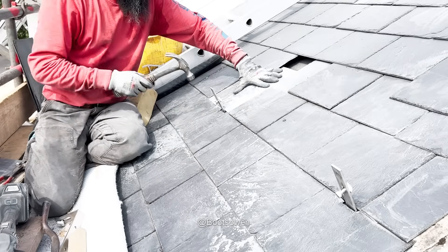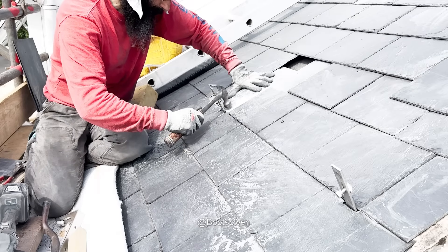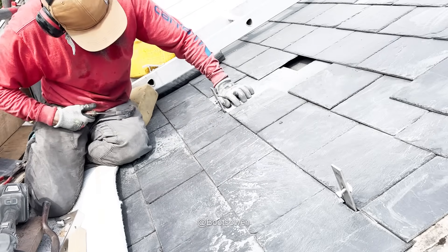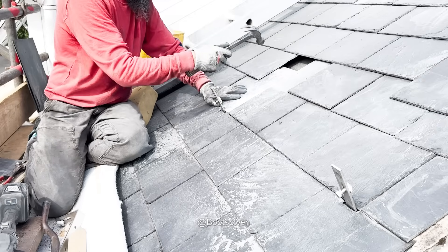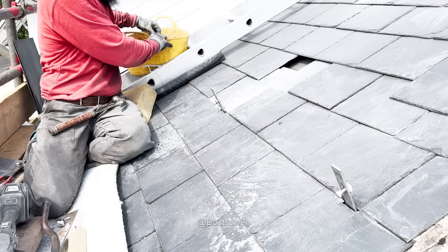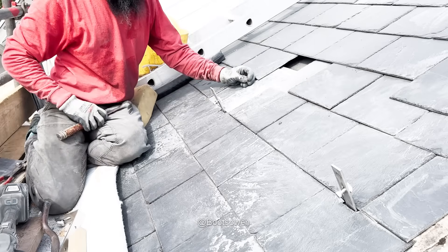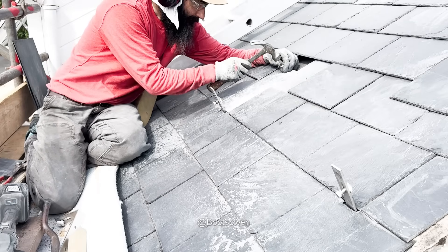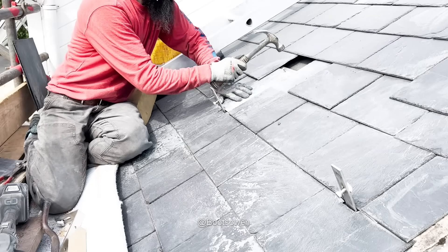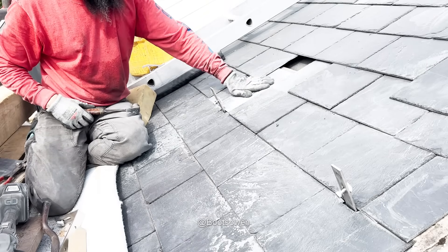There'll be another slate going on the left and then another slate going above, so we're pretty well waterproofed. It's very near the joint in the two slates above, so it makes sense to have that lead there. I'm just dressing it mostly so it kind of stays in place left to right. It's hanging on the bracket and I'm going to put a copper nail up above to hold it into the batten. It was about 30 degrees and I was just dripping sweat — I found putting a hanky underneath my hat stopped my ears getting sunburnt. I'd rather wear a long-sleeve shirt and gloves and heavy trousers in the sun than have sunburn.